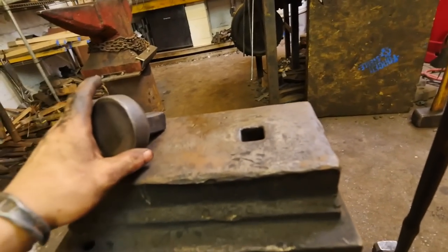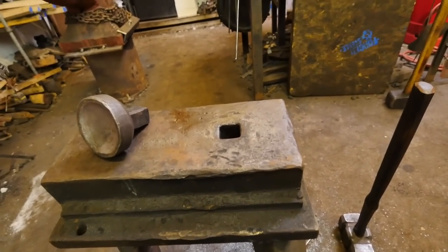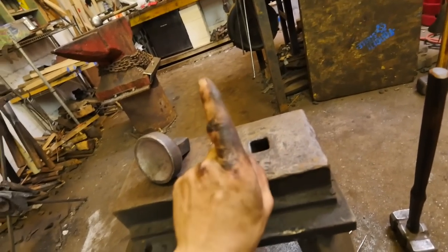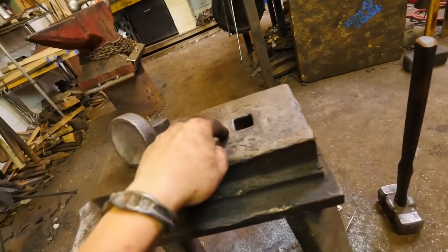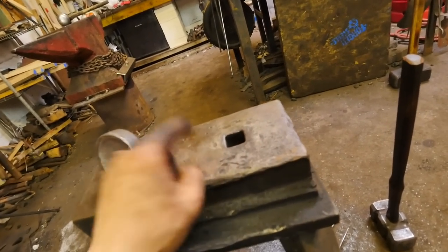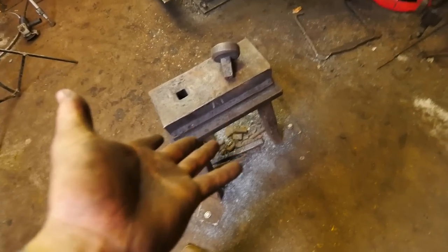If you don't want to buy a plate with a pre-made hole, it's actually pretty easy to make. All you've got to do is drill a 3-quarter inch or 7-8th inch hole, heat up the plate, and then take a 1-inch drift and gently drive the drift in from both sides, bit by bit. Don't go too far too fast. When you see a black ring of coldness around the hole, stop, take the drift out, and go from the other side — otherwise you'll begin bowing the plate, which is a bad idea. Make sure you go very gently, otherwise you'll end up with a bowed striking anvil. Really, there's nothing else to it. Keep it simple.